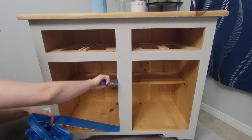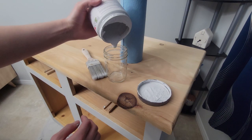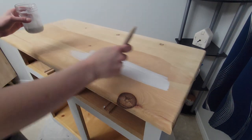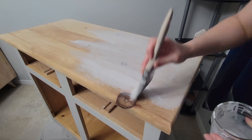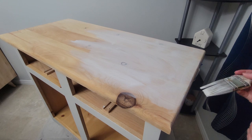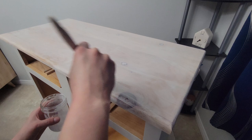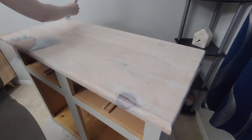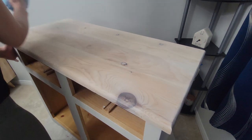After finishing the three coats on the sideboard I did a whitewash on the top. I had some leftover Country Chic paint so I'm just mixing a bit of that with some water — it's not an exact ratio, I just kind of eyeballed it. I then applied the wash all over the top and wiped it off with a clean rag. You want to make sure you're wiping it off all in the same direction as the wood grain to avoid any streaking or uneven color.